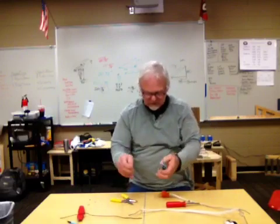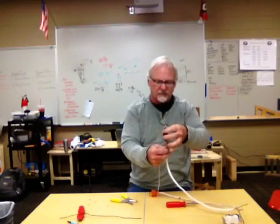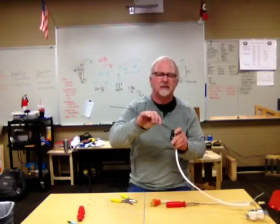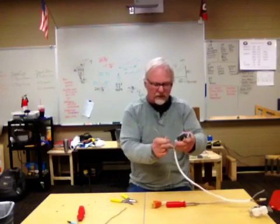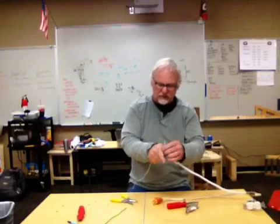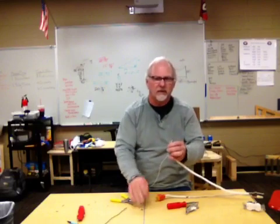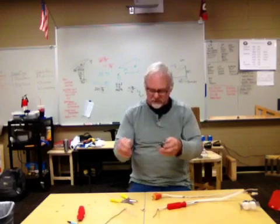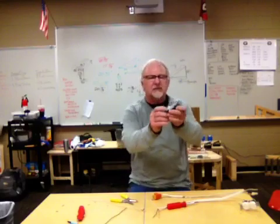And then you will take the white wires that are left, so we've got black wire attached to the bottom, black wire that you will strip and curl attached to the top, representing its lead to the light. And then we're going to have a white wire left here and a white wire left here. Well, I want you to take and just strip the 2 ends, do not curl them, and wire nut those together. All right? When we do a switch, we only have power in, power out. The 2 whites are wire nutted together to complete the circuit, and the ground is attached to the ground plug.